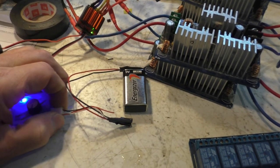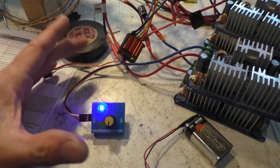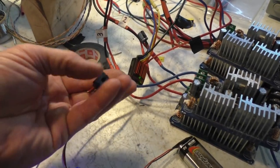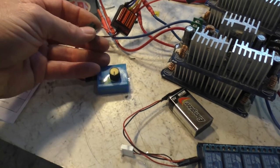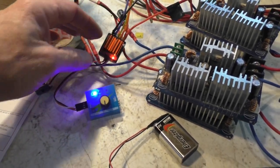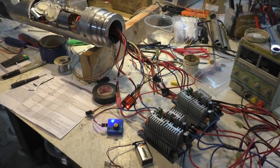It's using the battery eliminator circuit from the ESC for power — it is some kind of overpower shutdown. I'm not sure if it'll be a problem in water. This little switch at least works on this ESC — it will power down and back up — but since I can put it into a fault state the only way to reset it is to cut power to the ESC entirely, so I'll use the relays.